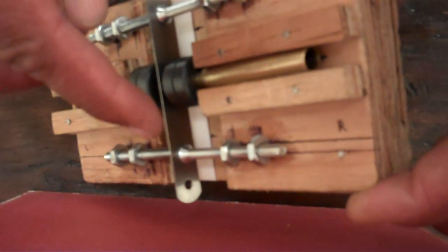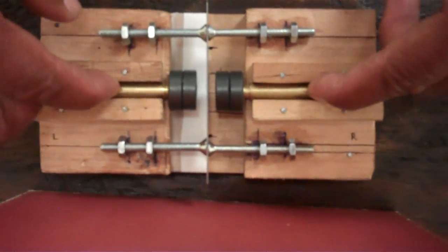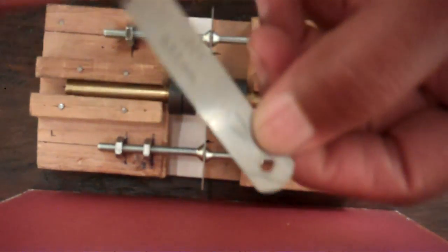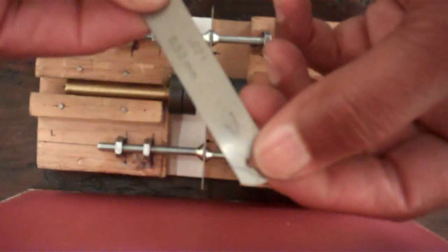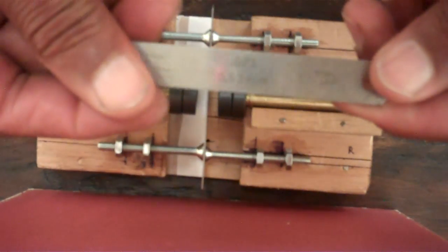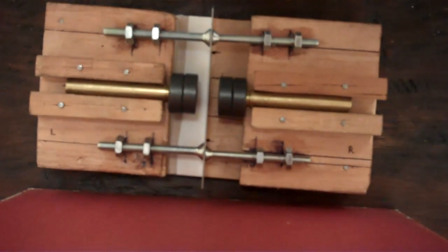I will show you the cancellation metal — it is right here between the magnets. The cancellation metal is simply spark plug gap blades. You can get these at auto parts stores — there are about 30 to 35 of them in a set for about $5 or $6. The magnets are small and cost about $0.25 a piece. These are different thicknesses: this one here is 0.021 and at the bottom here is 0.53 millimeters.